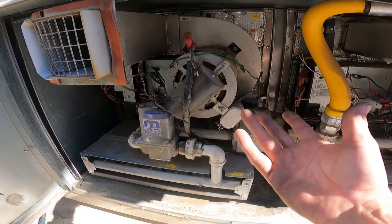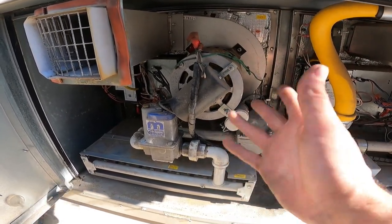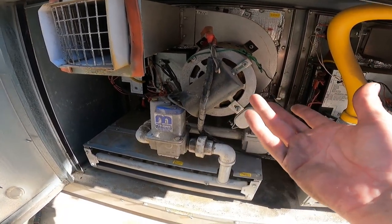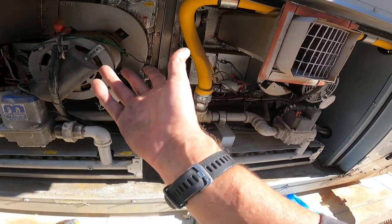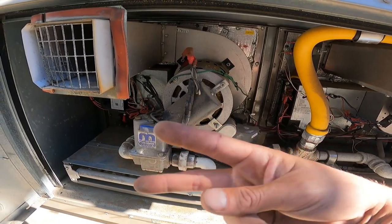And it's simple. You're replacing a draft fan motor, replace your limit safeties. Replace your gas valve, replace your safeties. You got a new heat exchanger, replace your safeties. Just do the thing. It's easy. Easy stuff. Anyway, that's all I got for you. I'm gonna wait for this clickety-clack thing to happen and this thing to turn back on. And I'll catch y'all on the next one.